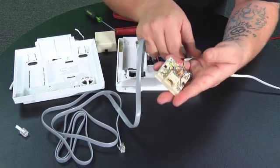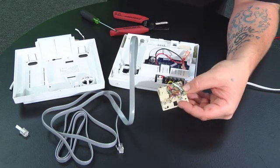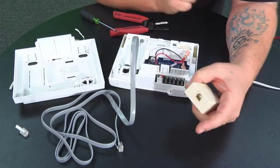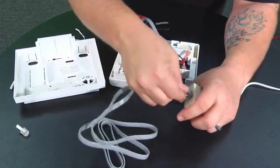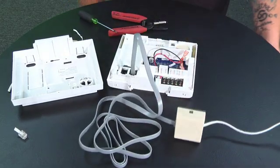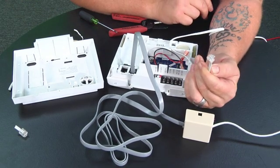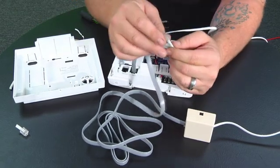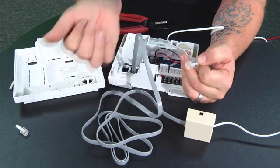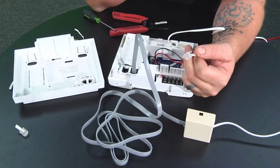Once that's done, bend the wires up and tuck them right inside the jack, then go ahead and reinstall the cap back onto it. Take this cord and plug it into the beige phone block. With the other end of the cable you'll be free to plug it into any phone jack. If you have DSL, the DSL company will provide you with little filters — just plug it into the filter and plug it into the phone jack. That's all you need to do, and then the system will be ready to program to call your own personal phone number should you desire.